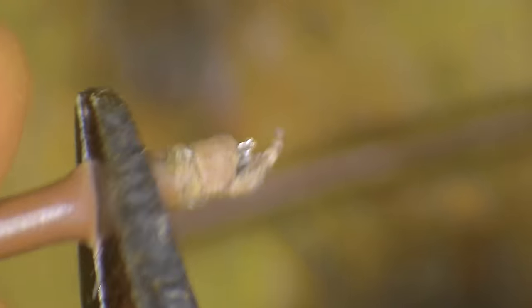That's basically a wire joint demonstration. The most important part is making sure that you heat what you're wanting to solder and then melt the solder to the component rather than onto the iron. The next thing I'm going to do is demonstrate soldering a component onto a board. I'm going to grab a little nondescript resistor — this is the board I'm going to mount it onto. You can see all the little holes. I bend the pins of the resistor and poke them through the holes of the board.